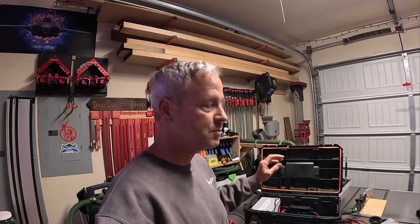And you might be asking, why am I doing this and not just one of my 100 power stations? This is fun. I like tinkering and building things like this, but mainly, this little 250 watt inverter is way more efficient than any other power station that I have over 1,000 watt hours. Typically the larger the power station in terms of watt hours, the larger the inverter, which is going to use more power. This way I've got over 1,000 watt hours in my Redodo battery with a very, very small inverter, so it's not going to take as much battery juice to run that inverter. So that's why I'm doing it. It's kind of backwards really, in a sense, a really small inverter with a really big battery. I don't have any power stations that do that, and those wouldn't sell very well.